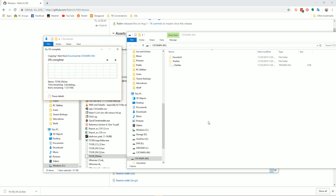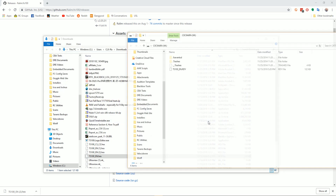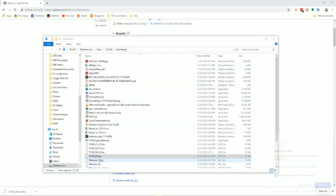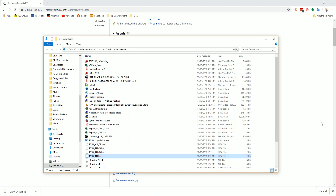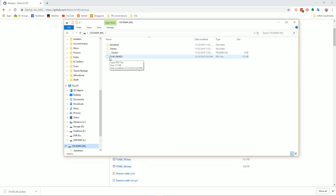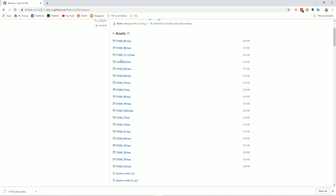When you do that, it's going to disconnect and reconnect, and the file is going to be renamed. Instead of .hex, it's going to be renamed as .rdy. When that happens, it means the upgrade has been successful. It's a little confusing because as soon as it finishes upgrading, it disconnects and goes away — but here it is, it popped up again. See how it says ts100_en.rdy, whereas it used to say .hex? That means the upgrade was complete. That's all there is to it. As soon as it sees you drop the file in there, it upgrades the firmware. Now if you unplug and power cycle, you should have a whole bunch of new functions, features, and menus.